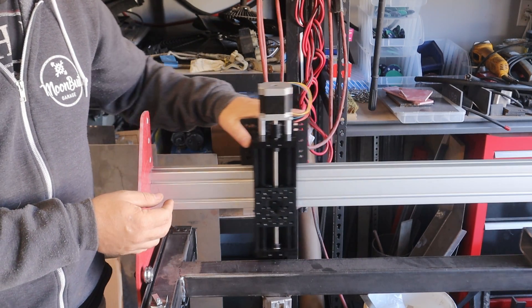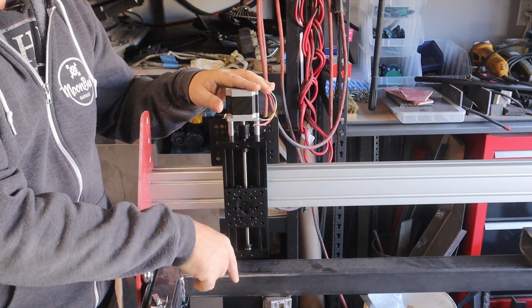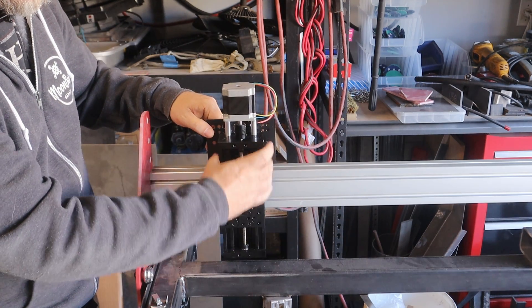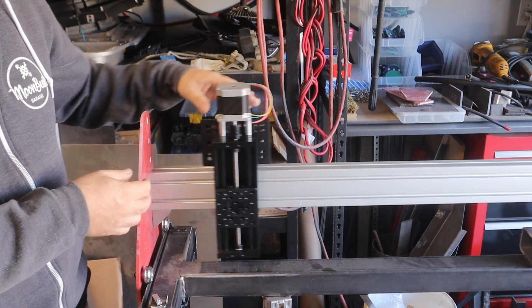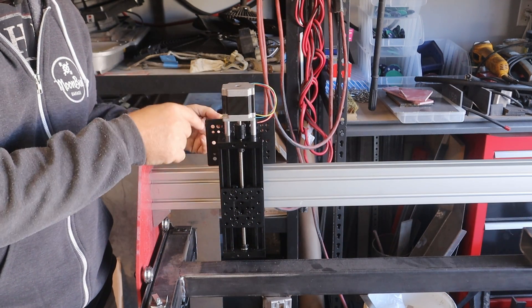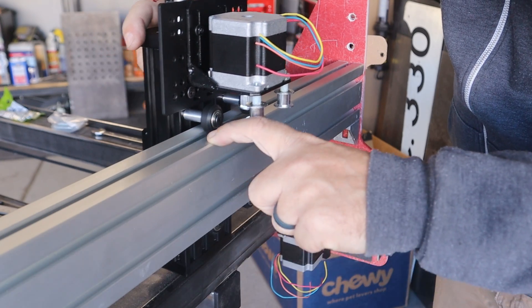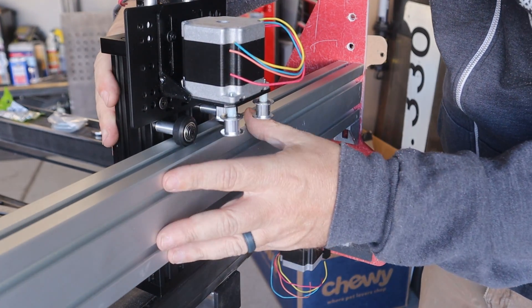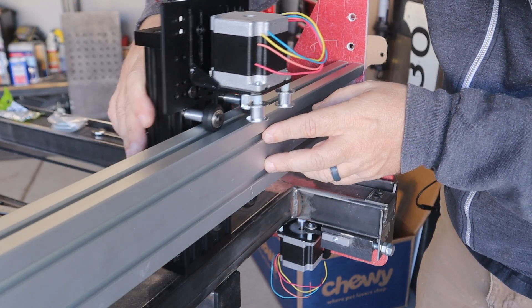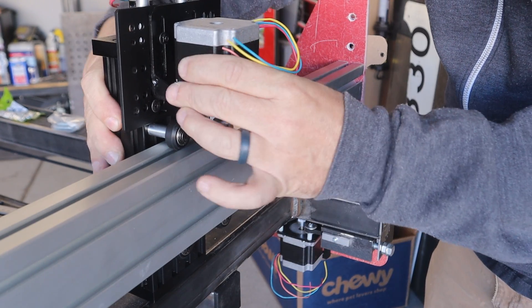For the movement of the X axis — if this was going to be a router or an engraver, something in physical contact with the cutting material, I would have mounted this on some sort of linear rail with a more positive mount. But for a plasma cutter, the way I have it mounted is just butter smooth and will work great. Let me take you around the backside. The way I have this mounted is just on rollers — two on top, two on bottom — and they ride in this groove on top of the linear rail. For a plasma cutter where this just needs to float, this is more than enough, and those wheels have enough positive contact in that groove that this thing is not going anywhere.